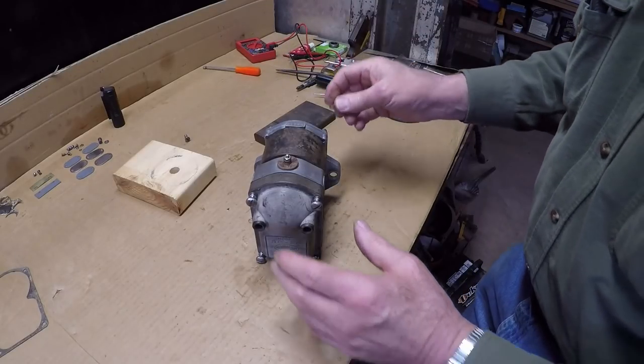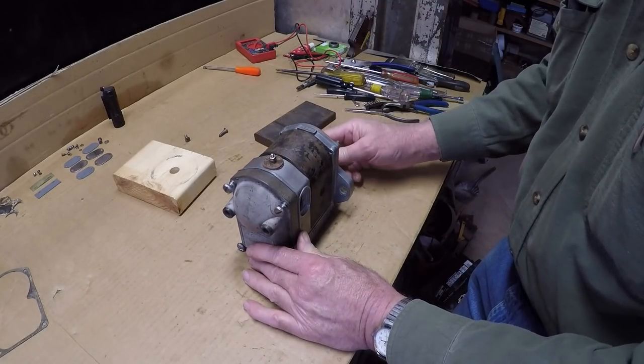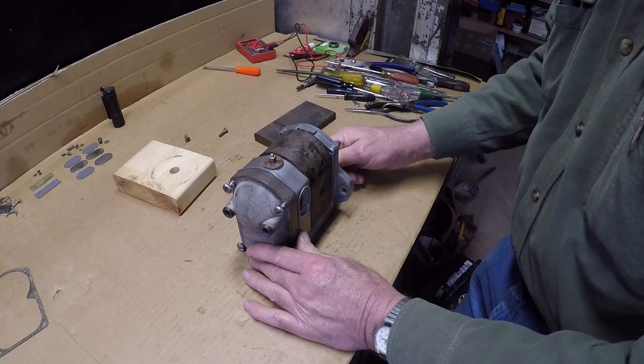Next I'll put a light coating of oil on the top bare metal surfaces and slide that on and get her bolted down. Remember the magnet has an N marked for north and the housing also has an N for north — so you match north to north to get the magnet installed on the housing in the right orientation. Screw her down and get her fastened in. Next step is to put the drive gear on and give her a test.